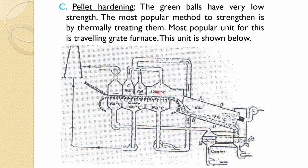Then it comes to the high temperature zone about 1200 degrees Celsius. When it comes to that one, fusion is occurring and you have an updraft here. So, now before that you had a downdraft, now you are having an updraft, and the hot gases actually are coming from the rotary kiln. So, from these hot pellets, they fall, they are fed to the kiln where the temperature is quite high, about 1270 degrees Celsius, and from this to this journey the induration of the pellet with fusion occurs, and